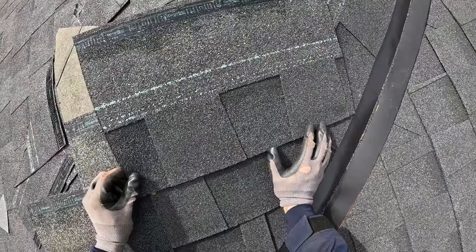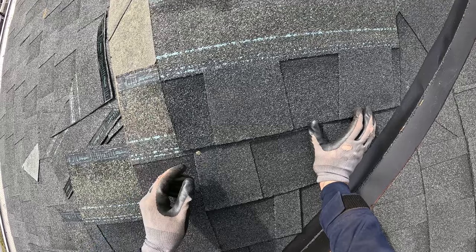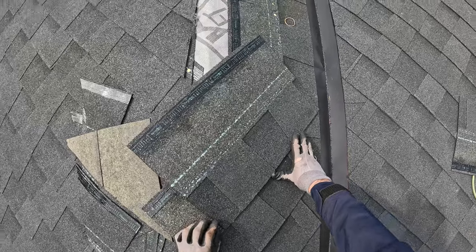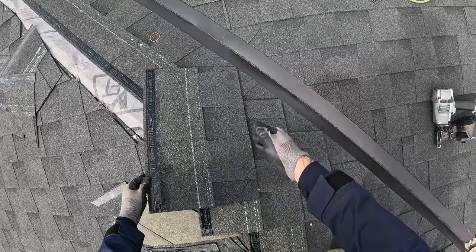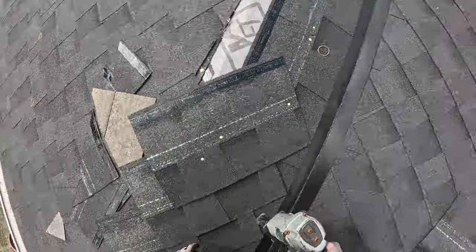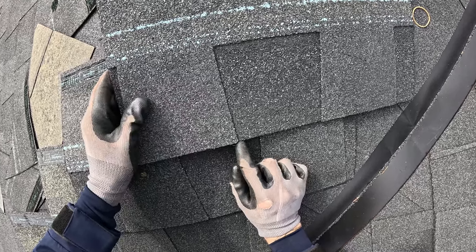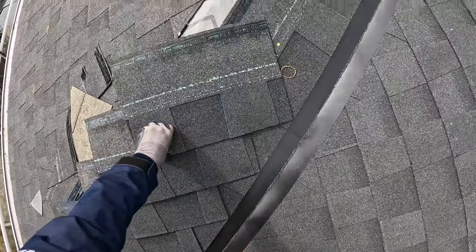If you do have to cheat and move stuff you can, but you have to do it in small increments. You can't run a shingle up too aggressively — you'll see it for sure, maybe not down here this low, but you have to be mindful of that. If you're trying to make a recovery move, these shingles are lining up nice now, and hopefully the shingles don't have any defects and I can just lay them flat. There's even little imperfections here — all of that adds up. As you get higher they get more and more out, so you just have to be mindful.